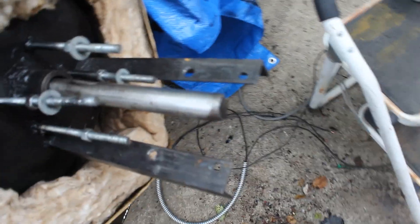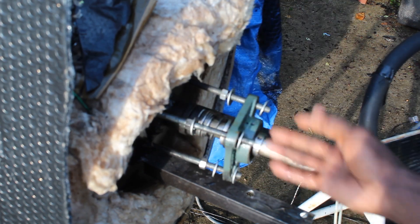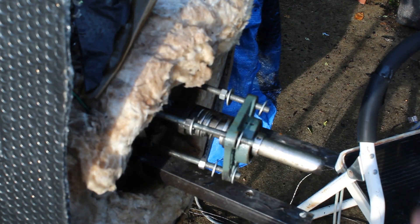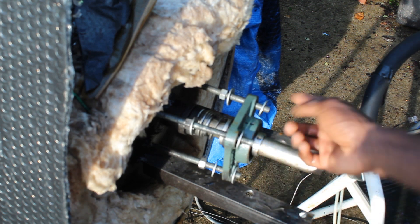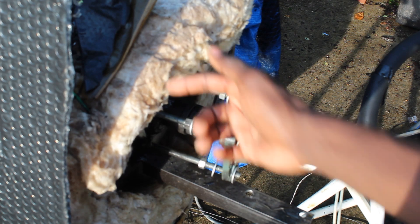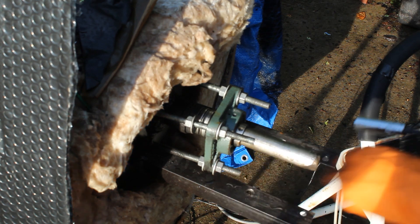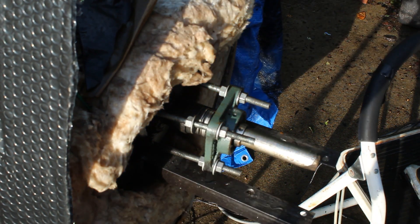Got them in. Now I have to install the gearbox and motor. So this here is the shaft seal — this is what's going to, with this spring, be pushed up against this to cause a ton of pressure, forcing a mechanical seal against this bit of metal here, allowing us to have pressure and vacuum built in this machine without losing that. And then this here is the bearing, which right now is being suspended on these all-threads, and we're going to go ahead and screw it down.